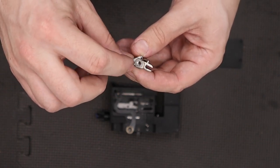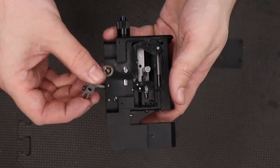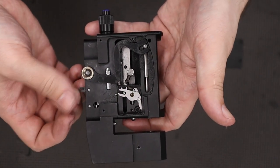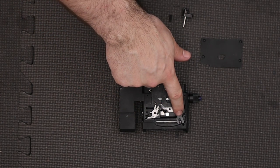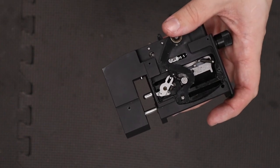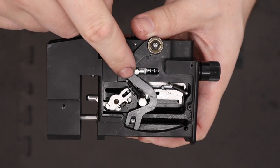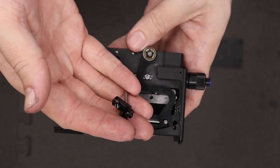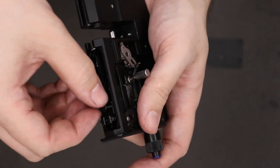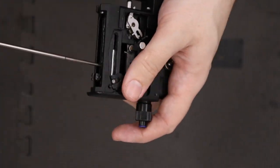You don't want tons of this stuff, just a small amount — we can always wipe off the excess. This piece needs to go over this pin here and also hook in on the back. It's a lot easier to do that when the rifle is cocked. After that we can decock the rifle and then using a set of tweezers get this spring hooked over this pin. With that done we can take our cocking linkage and get that installed through the pellet probe, securing that with the small countersunk screw and getting that done up using a 2mm Allen key.